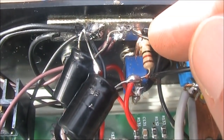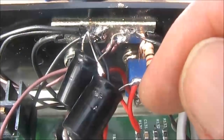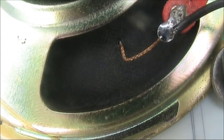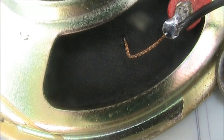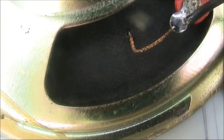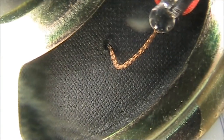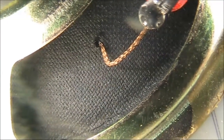Just to demonstrate the effect, here I have a wire shorting out the 12 ohm resistor in the power lead of the DDS VFO. This is with the filter out — i.e., the wire across the resistor. Now I put the filter in — i.e., with the 12 ohm resistor in line — and the internally generated noise disappears. Let's do another comparison: with the resistor out, you can hear the noise; with it in, you can't.